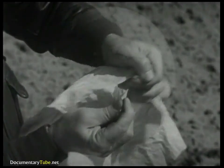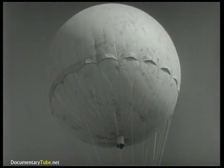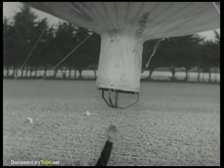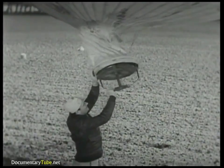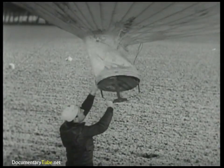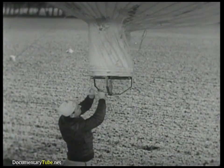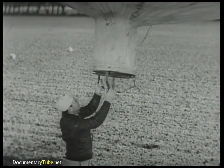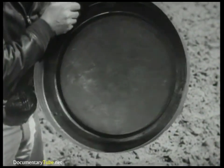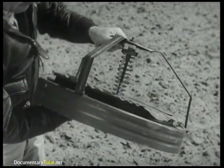The total weight of the bag is about 150 pounds. The bag is 33 feet in diameter and holds 17,500 cubic feet of hydrogen gas. The escape valve is of the single disc type, 17 inches in diameter. It is made of pressed steel and has a rubber gasket for a seal. Pressure is regulated by a spring; release pressure is set for nine-tenths of an ounce per square inch. The valve is mounted on a three-leg spider bracket.